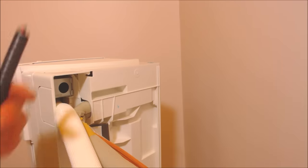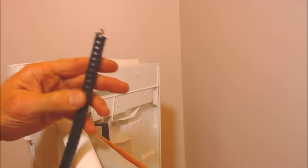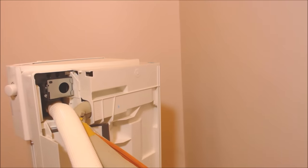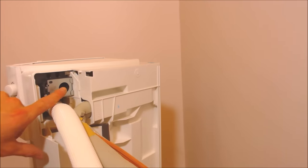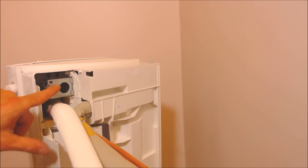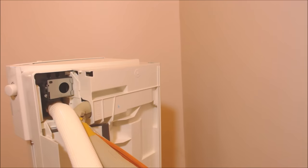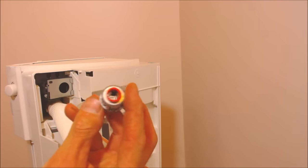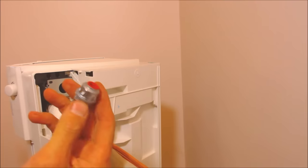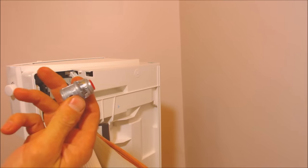Now we're inside — we have our South Wire EZIN cable brought in through the hole from the outside to the inside. Here we have our head unit. If you had a standard connector you'd have to unscrew this right here, but we have a snap-in connector for the MC wire. We're going to strip this back roughly about one foot and use our snap-in MC connector.